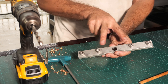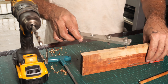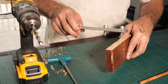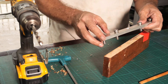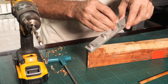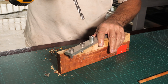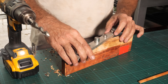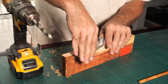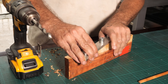I have two sets of bolts at two different distances from the center hole. Most of the time I will be using the shorter distance, and sometimes for big thick material I will use the outside bolts. Now we are going to test it. Here is the moment of truth — I'm holding the jig and pushing these bolts to the walls. This bolt goes on this side because the drill is rotating to the right, so it will be locking the jig. If I put it the other way the jig will fly with the drill bit.